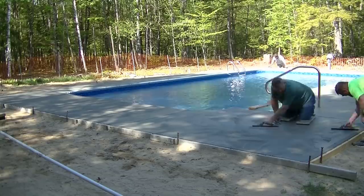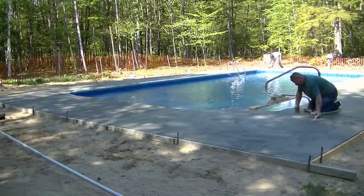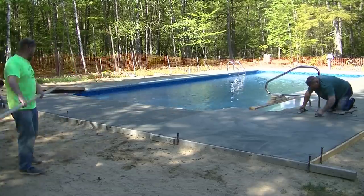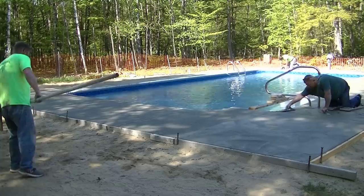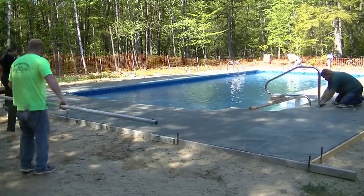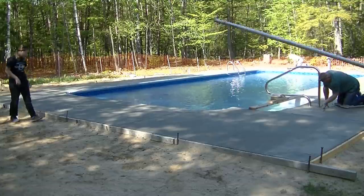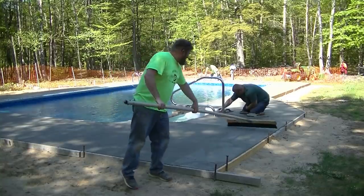You can see it's set up pretty quick. If Luke can get on there with those knee boards and work his way around without sinking in, then this stuff's set up pretty quick. I'm way over there in the back in the sun, mag floating out that piece. It's basically all setting at the same time right now — if we wait 5, 10, 15 minutes, we're going to start getting behind, so we just want to keep working at the same pace. We kind of mag out one square at a time — from one joint to another. Darren will get it broomed, then jump over to where I am and broom my next square before it dries up. Tia follows behind with the edger to make sure she gets a really nice edge mark in it.